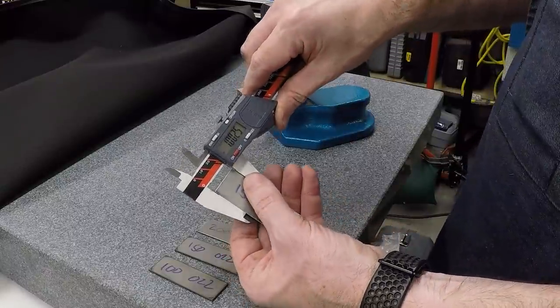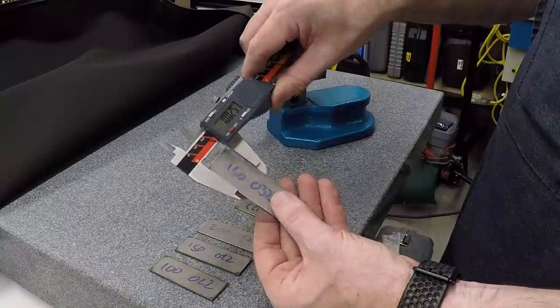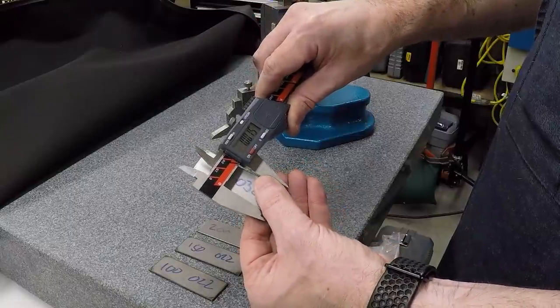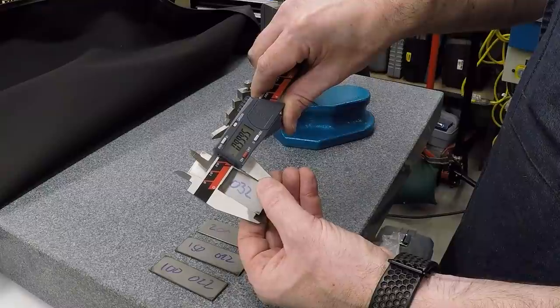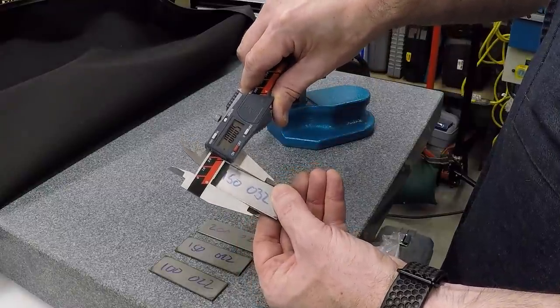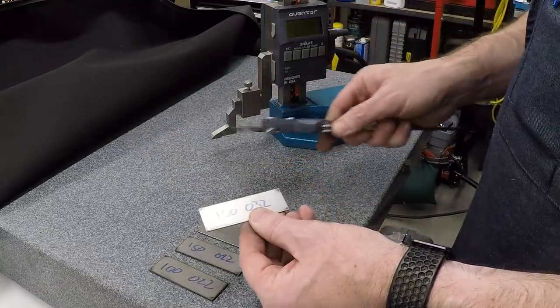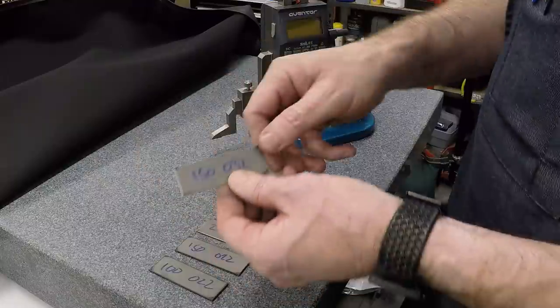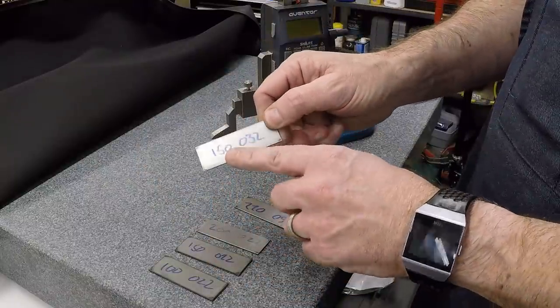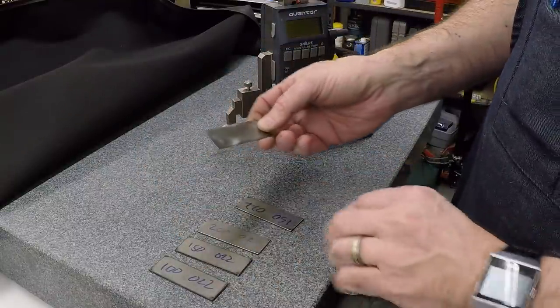and now we're getting this right there, I'm measuring 1 inch 2 thou. Here I'm measuring half a thou under an inch. Here I'm measuring half a thou over an inch. So we're pretty much right on now with this part. So setting it up for a kerf width of 032 and 150 inches a minute is getting me results that I can live with that are very, very close.